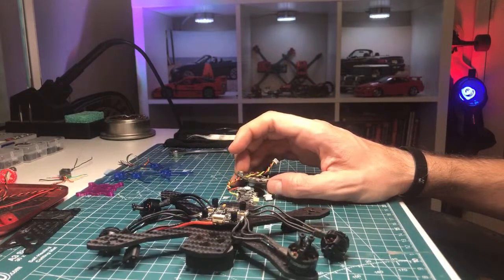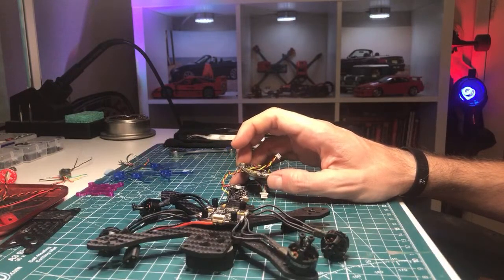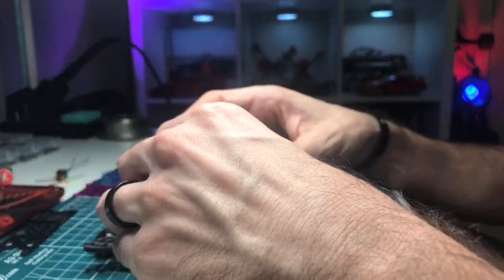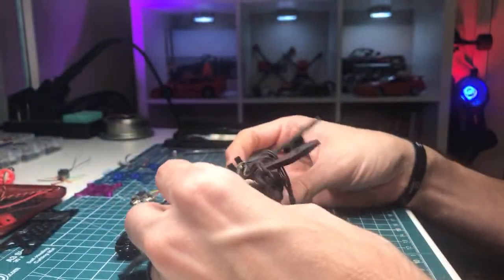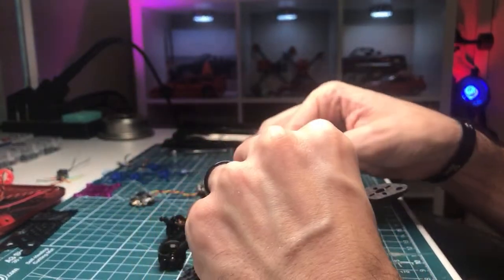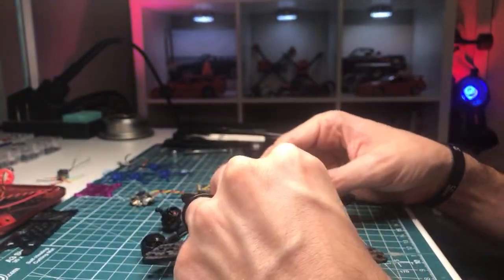Thanks, House Blog. Does a cap on a 4-in-1 prevent death rolls? Probably not, Spudnik. Death rolls are, for me, most often caused by a failing ESC or motor. I doubt, you never know, but I doubt that a capacitor would help that.